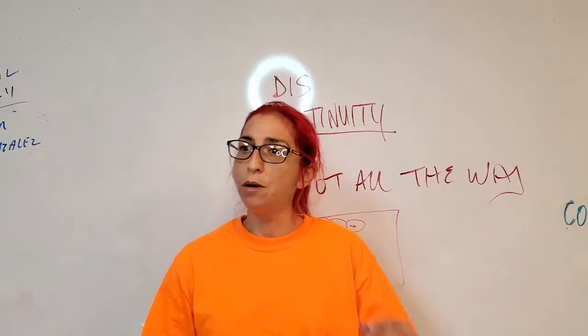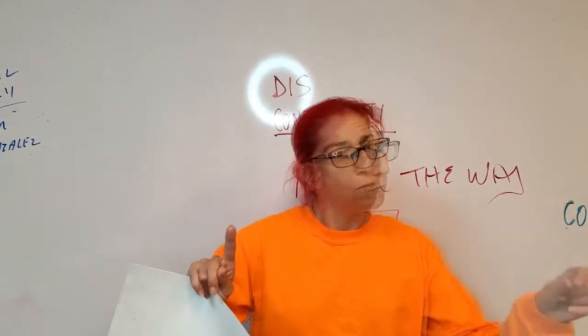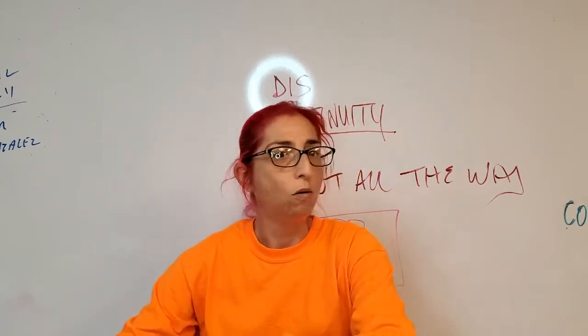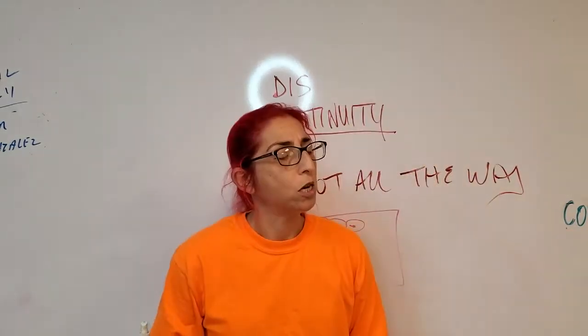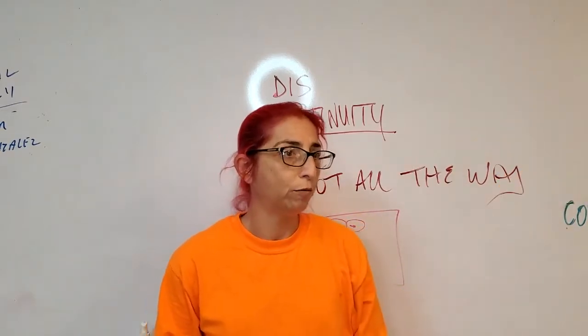We have a certain amount of amperage that needs to go from one end to the other, right? For our rod. If it's too low, it's just like that hose when you turn it on, right? If it's too low, by the time it gets to the end, it's not enough to strike on your material. Okay, so you need to make sure that you pay close attention to that. That's what we were talking about, like pulling off the fluff or the slag.